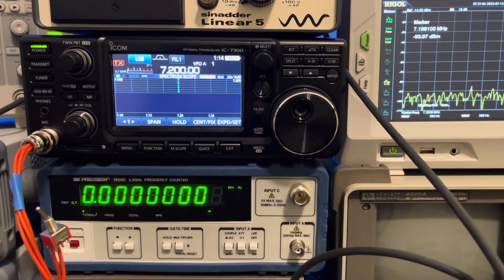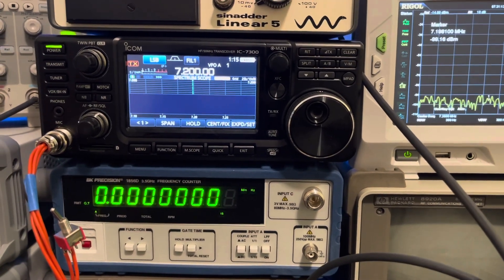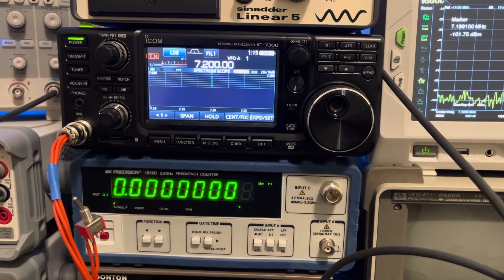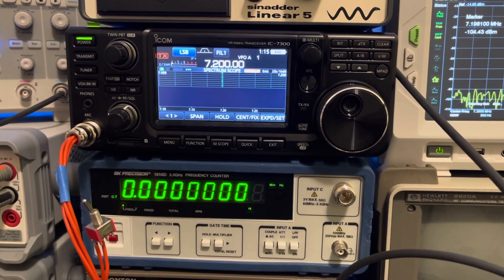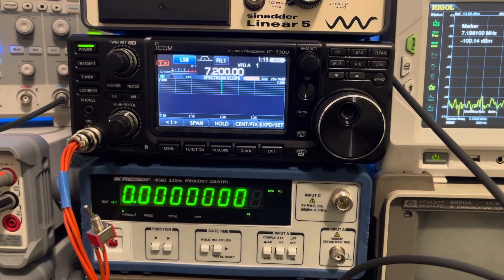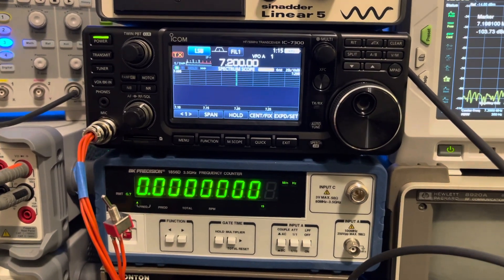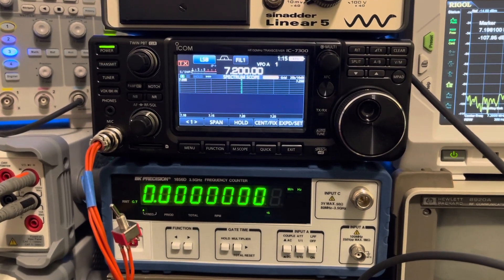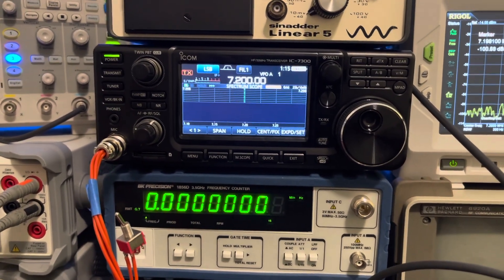If you've watched my previous videos you know I'm a big stickler for the lowest amount of intermodulation distortion possible, and I think I'm pretty much happy with the settings I picked with the 7300 to get that. The engineers that designed this algorithm for transmit output on sideband really hit the mark, whereas maybe Yaesu didn't quite so much. On a Yaesu there's a lot of variance in software settings where you can create a lot of intermodulation distortion depending on mic gain, speech compressor, bandwidth — and not know it.